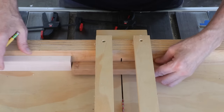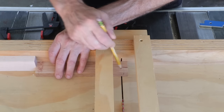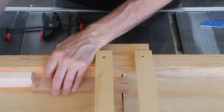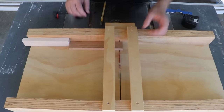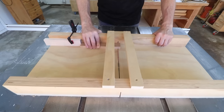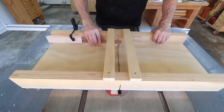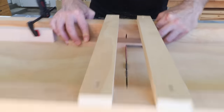In order to do that I just need to set up a stop block. I'll set it up so that this side will be 3/8 of an inch from the blade. My first setup will be just slightly shy of that 3/8 inch so that I can sneak up on it. I'll just clamp this stop block into place. This is a perfect reason to make yourself a crosscut sled if you don't already have one. This small piece is just so much safer with the sled since the work piece stays stationary through the whole cut and there's no friction against the table. Plus the sled's base has a zero clearance slot for the saw blade so you'll get a cleaner cut.